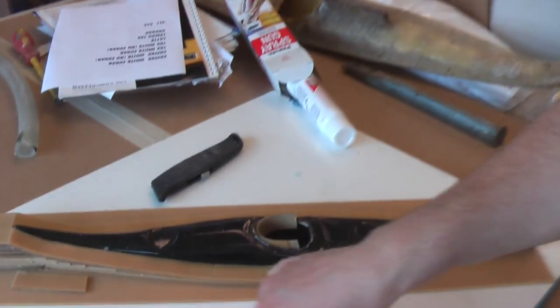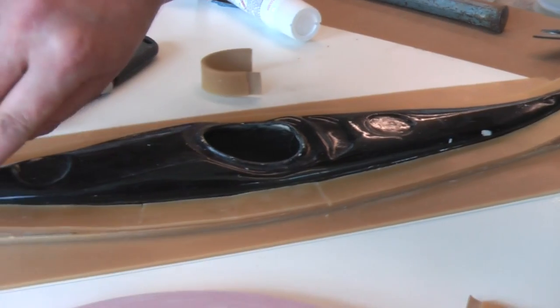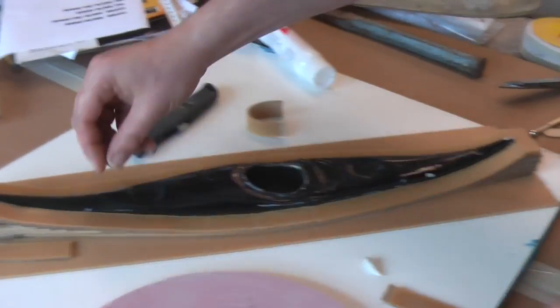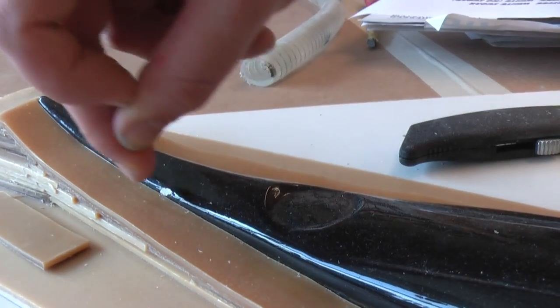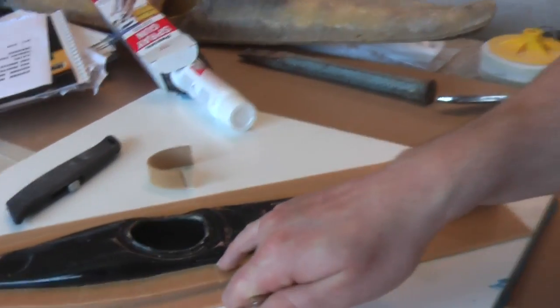So now we've got the model all flanged up with our little inch rim going round following the split line. We're then going to fill all the gaps with plasticine to make sure none of the gel coat or resin can get down there. We're also going to check the model for any imperfections and fill those up with a little bit of plasticine — you can see one there, just a little hole in the item. We'll fill that in with a bit of plasticine. Make sure when you do fill them in, it's slightly indented — at least then you can rub it out of the mould when it comes out. Whereas if it's slightly proud, it ends up being an indentation on the mould, which is harder to rub out with wet and dry papers. Just go around the split line and fill any gaps up with plasticine as well.